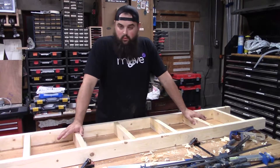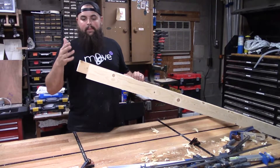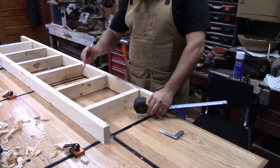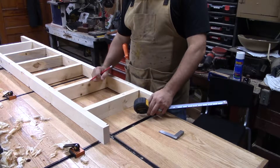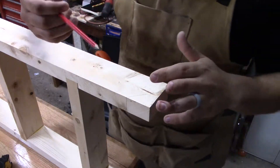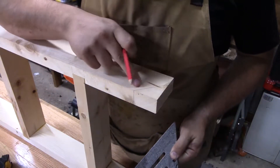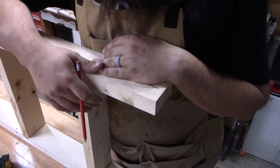Alright, we're all flushed up. Before we start sanding, I want to add a little decorative chamfer up here — I'm going to add a little miter just to soften this hard corner so when you're climbing up you're not hitting your knee on it, because inevitably that's what I would do. I marked down two inches, took a speed square, and lined up a 45-degree line with my bottom two-inch mark, and that's going to be my little decorative edge. Really the angle doesn't matter — this is just for aesthetics to break up that harsh corner. So let's cut it out.